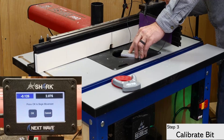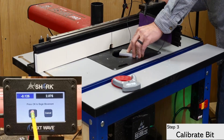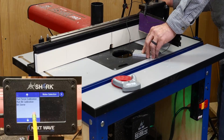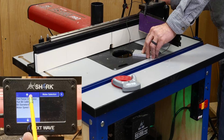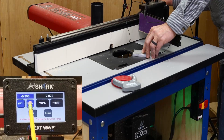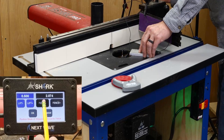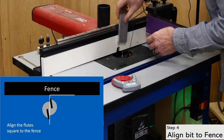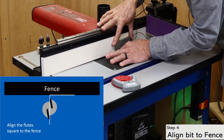Next, open the fence calibration option. The bit will rise up until it touches the bottom of the plate, and then retract down below the surface. Click through to the screen that has the white control button and press that button. This screen allows you to move the lift and the fence without going back to the main screen. Before calibrating the fence, it's important to rotate the bit so the flutes are 90 degrees to the fence. That way, the high point of the flute is closest to the fence, which guarantees an accurate fence calibration. Rotating the flutes on a spiral bit is not as critical since they wrap around the bit, but I still do it as a best practice and a good setup habit.